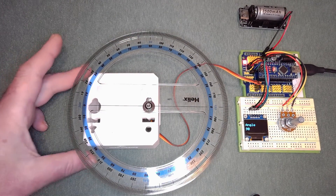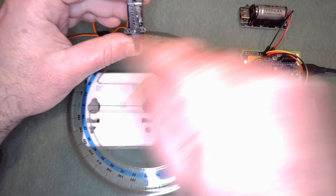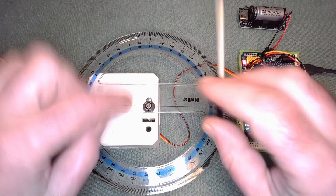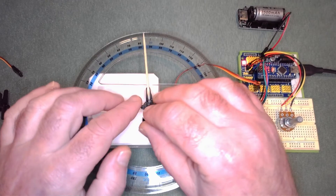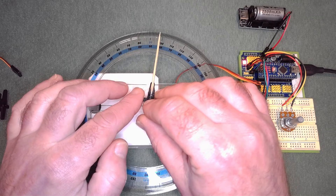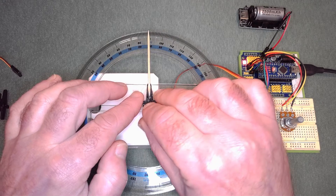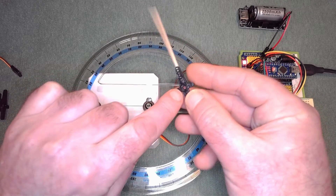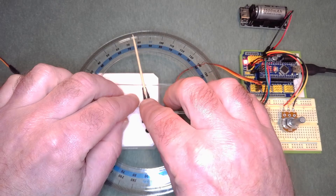So what's the issue with Otto? You've centralized the horn, checked your 180-degree rotation, and now you come to popping the horn onto the spindle. With the 17-degree spacing, we get up to an 8.5-degree error either side — that's the best/worst scenario. If you're very lucky you'll land close to 90 degrees; I've only got about one or two where it's spot on 90. Everything else is slightly offset when you pop the horn onto the spindle.